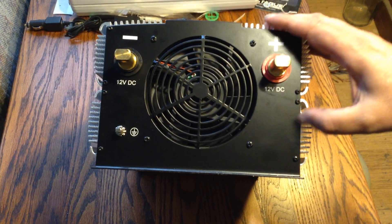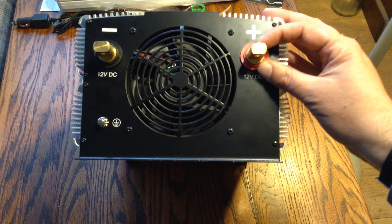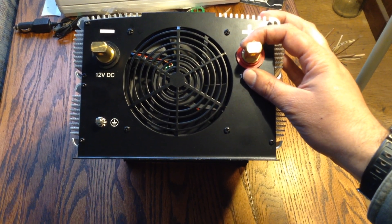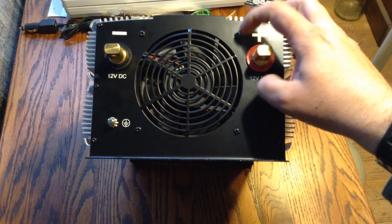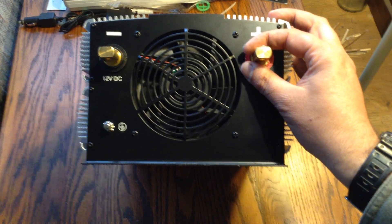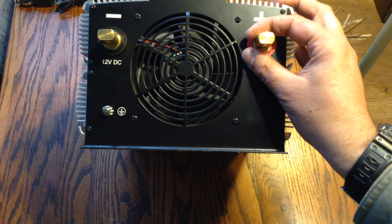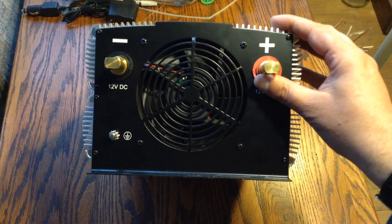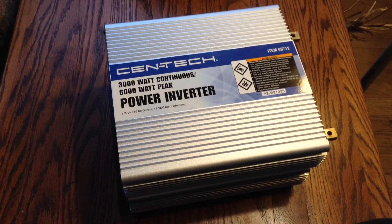This cooling fan is basically twice the size of, say, a 1,200 watt inverter's fan since this unit is twice as tall. You also have some pretty big, hefty lugs. It comes with through bolts, part of a design request from people who wanted to use jumper cables to get power to the inverter. If you're using it temporarily at a job site, you could power it with jumper cables, but cheap jumper cables won't push enough power to run this at full capacity. The 5,000 watt inverter has two sets of leads to deliver sufficient power.